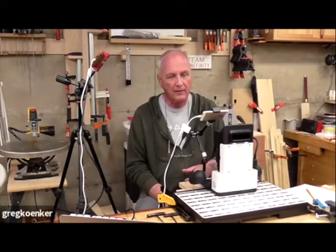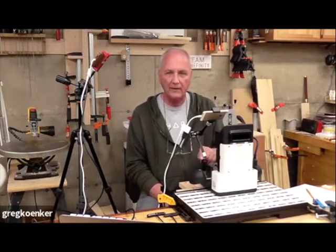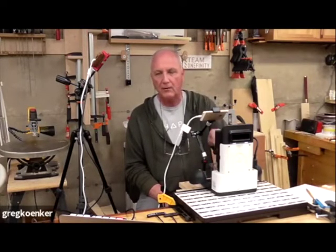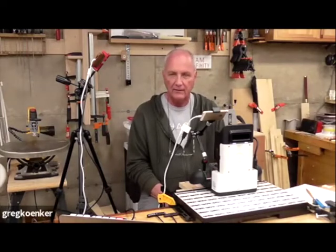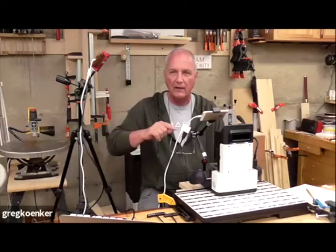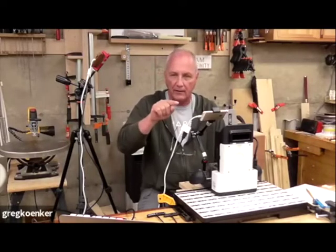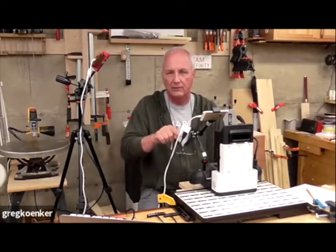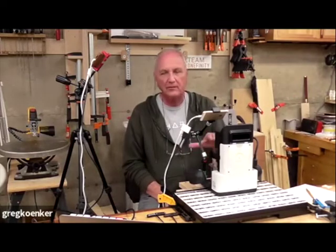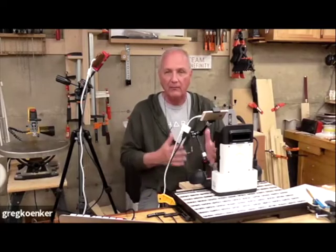The other thing that I brought up briefly is that this is a 2-axis machine. It really is 3-axis in a way, because it does control depth. It controls how deep the bit is going, but it doesn't do it dynamically. So it doesn't allow you to carve something 3D that has elevation change in it. You have to tell it you're going to 1/2 inch deep, 3/8 of an inch deep, whatever, and you're not going to do that on the fly. So consider this a 2-axis tool where a gantry style is 3. So that right there limits it.